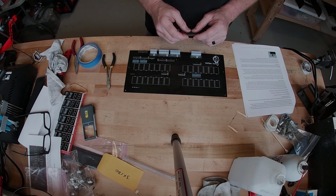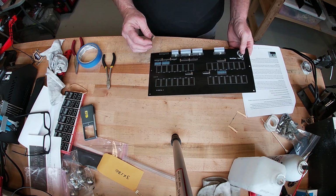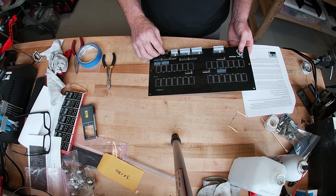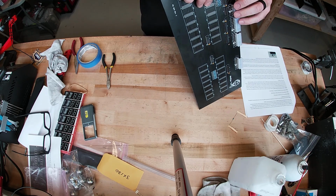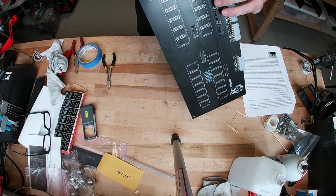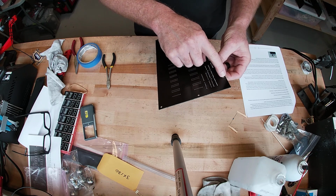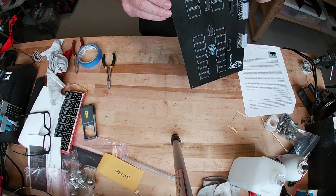The last connector is the little ribbon connector, and it's going to go up here. You put the small end of the pins into the board so the others stick up top. Same thing, you're going to want to have the black plastic flush against the board, so you just want to be able to hold it, and I'll usually hold it at one end, so the pins I'm soldering, these are the hot ones, and so usually it doesn't bother me down here.